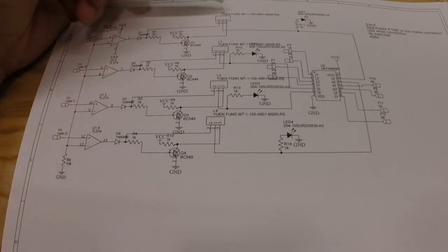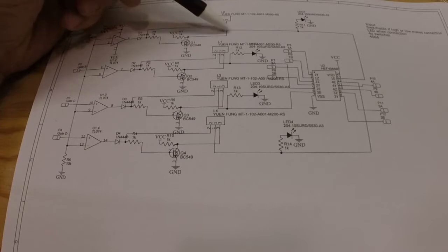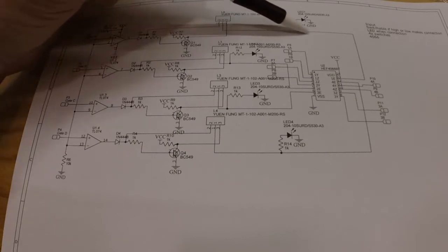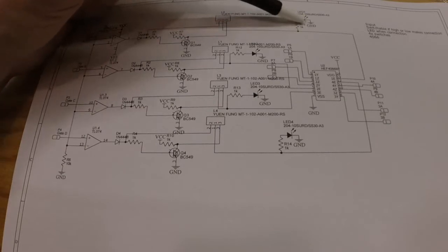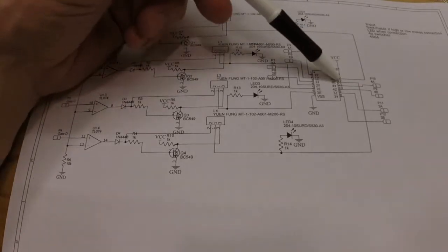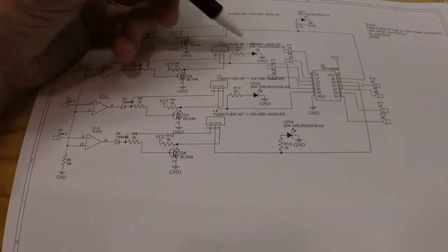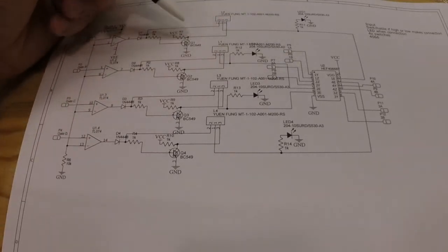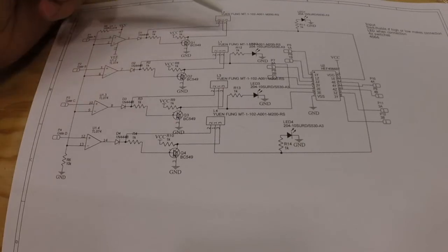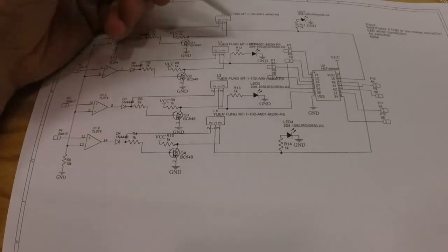So to make this circuit much more interesting, I added a switch between the inverted and the non-inverted input. So this means that the control signal that goes out here and lights an LED, whether it's on or off, is either with the switch pressed when there is a gate, or pressed when there's not a gate. So that's why we use the inverter here. So that means that we can switch the way it acts on gates.